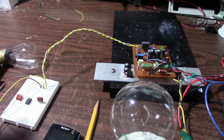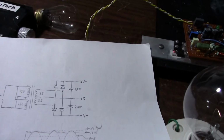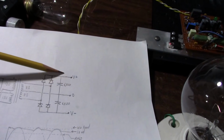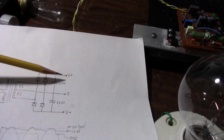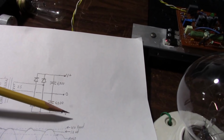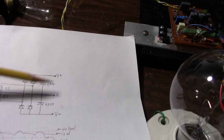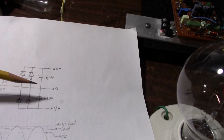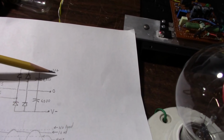One thing I would like to mention at this point is when you build an actual power supply, I very strongly encourage putting fuses after the main filters on each rail. 3 or 4 amp fuses. If you use it with 4 ohm loads, with this amplifier, probably 4 amp fuses. Fast acting. And yeah, you heard me correctly, after the main filters.